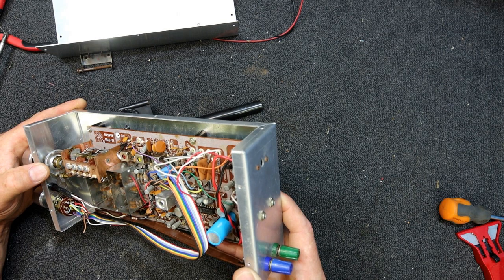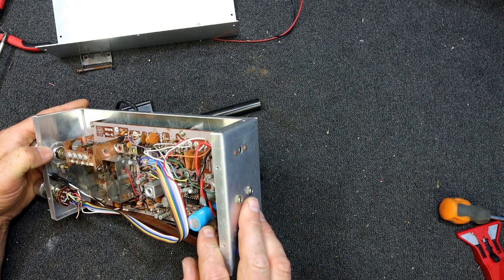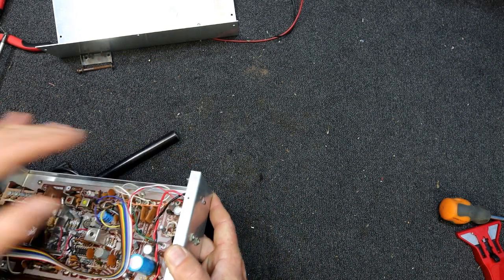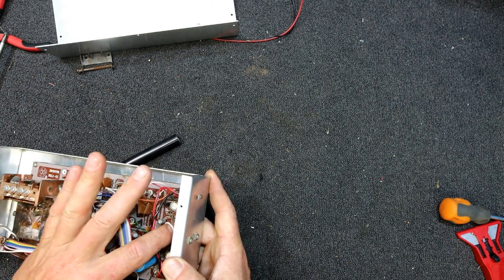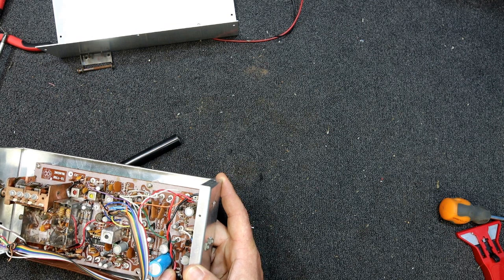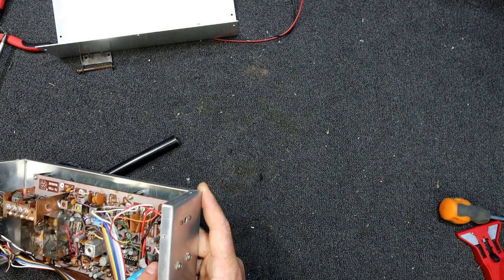220 16 volts, so maybe there is a little voltage regulator there of some sort. Positive comes in through a 2K2 resistor. I assume it's not a voltage regulator. No, it's a 2SD468, so that's likely to reduce the voltage down from a higher voltage, maybe to 12 volts. Maybe it has its own regulator. I'm not sure what on earth that little thing is.